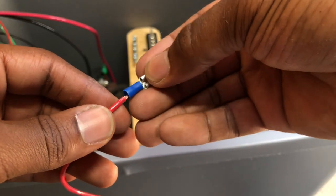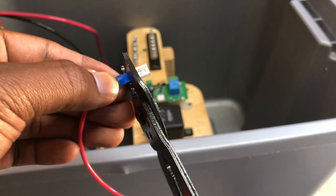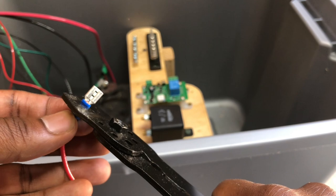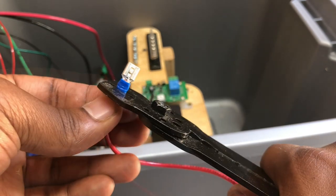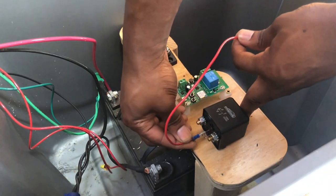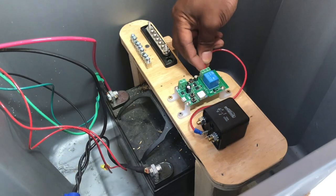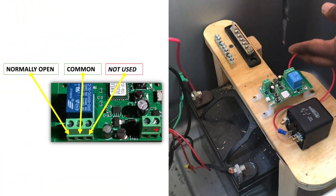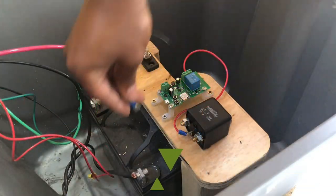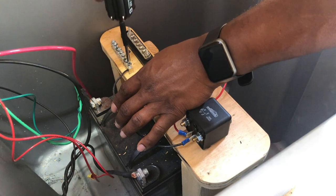For many of the electrical connections I needed to make, I had to use a variety of electrical terminals. To keep the video a bit shorter, I will not show myself adding terminals onto each wire, but the process I used is very similar to this quick-disconnect terminal I'm adding to this wire. I will also leave links in the description for where you can find the components and tools I'm using. Next, I started to wire up my WiFi controller's relay to the new heavy-duty relay. I used the normally open side of the WiFi relay so that if I lose power to my WiFi controller, my pump would turn off by default. You can also find an easy-to-follow picture-based electrical diagram in the description below if you have a hard time following what's connected to what.